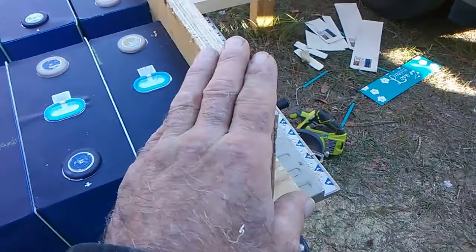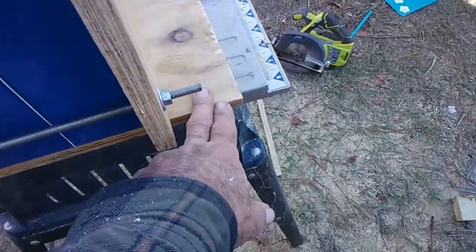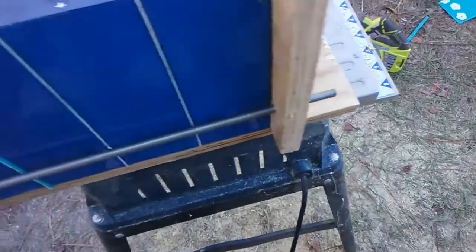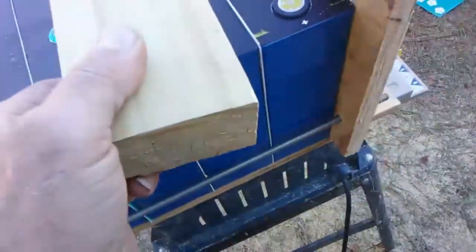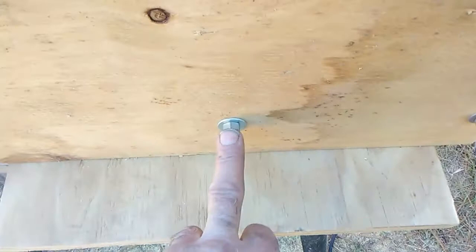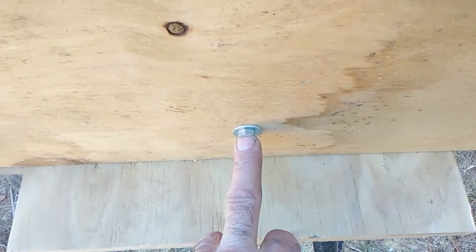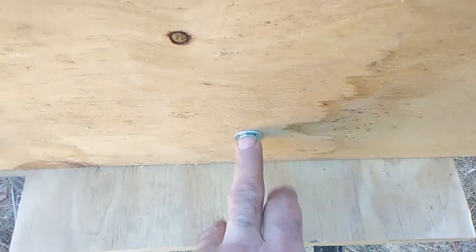You get your sides cut from three-quarter plywood, and the bottom, and set it down in place. What I'm doing to start out is compressing the bottom. I've got three threaded rods outside and one in the center, pre-compressing it. I'm not using really excessive pressure — just good and snug.